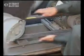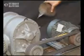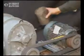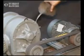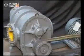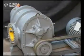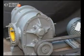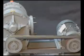In case tight movement is observed, pour about half a liter of kerosene into the main casing through the suction or discharge port and try again after a lapse of 10 to 15 minutes. Once it is free, run the blower with motor with suction and discharge open for about 10 minutes to expel the kerosene out. The blower is ready to be connected to the system now.